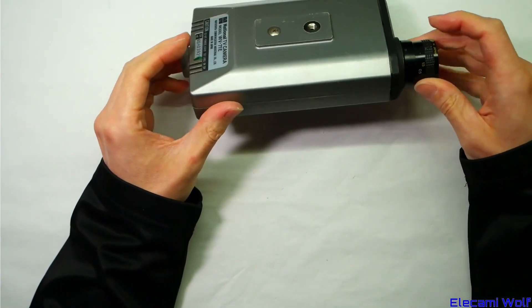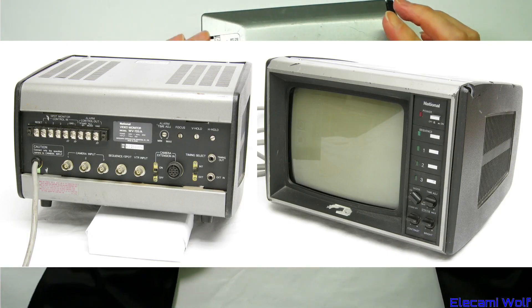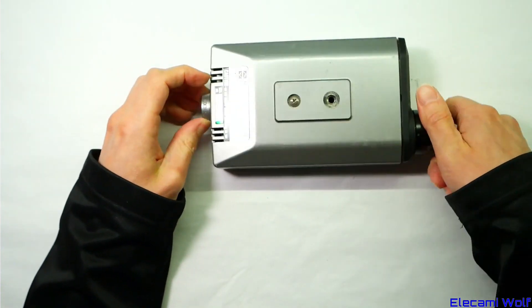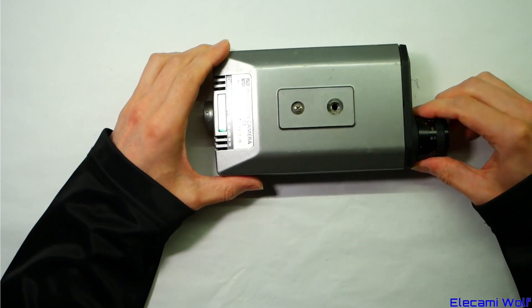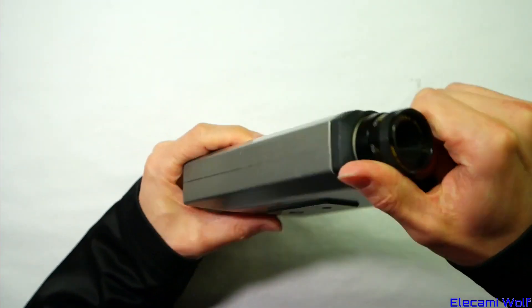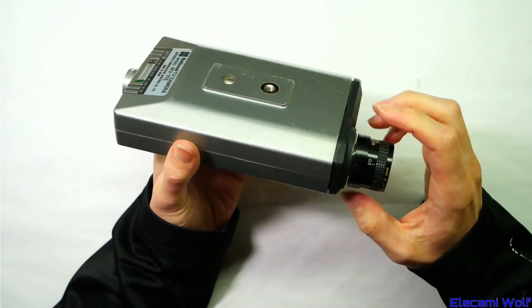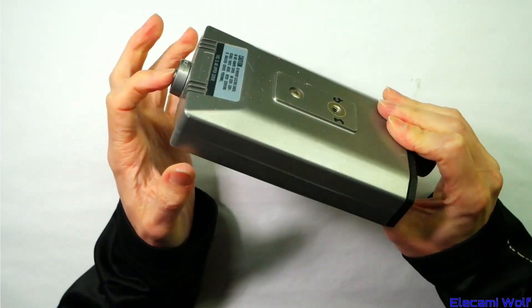I had one of those - don't have any more - which is built into a small black and white monitor, and it connected up to three cameras, and then had options for automatically cycling through them, or manually. It had various I/O for controlling it from an external system, and outputs for recording, and also an external video input which would then sync all these cameras to it. Interesting system - makes wiring a lot easier, you just run one cable to every camera and don't have to worry about power. This is black and white only; I think there were color versions of this system with one coax.